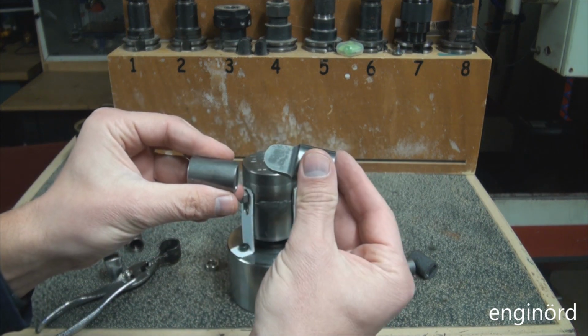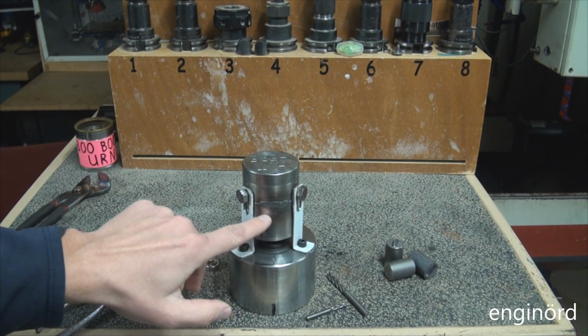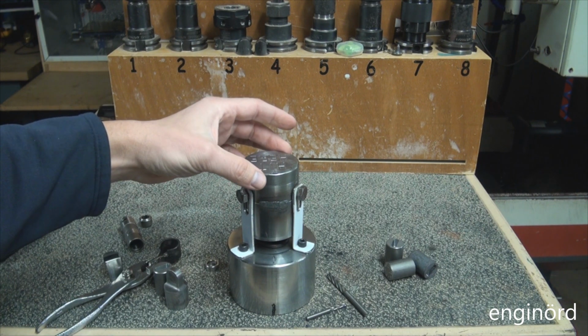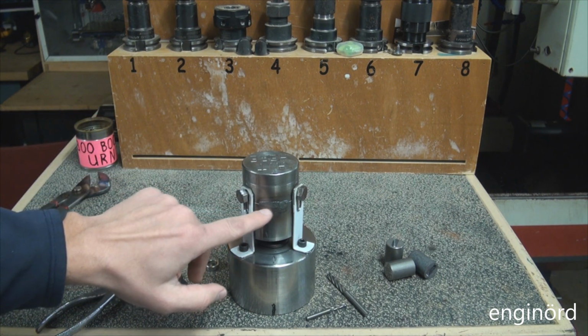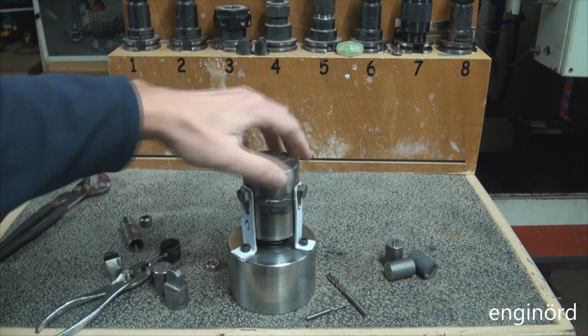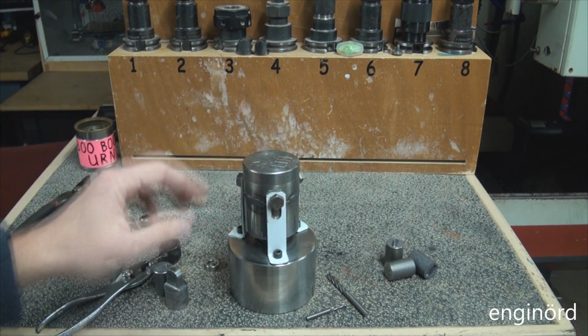It just goes to a certain depth. So this tube had a press fit with the upper section, and it was always breaking loose. So what I did is I welded it around, so now it's a single component basically.